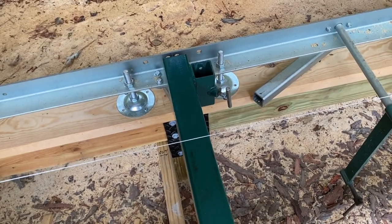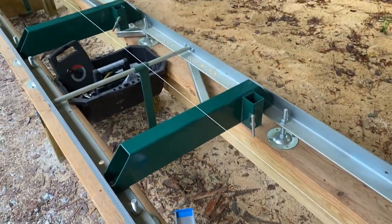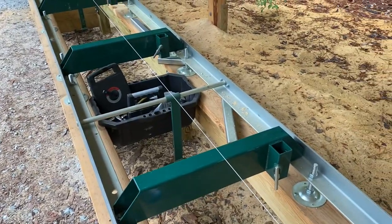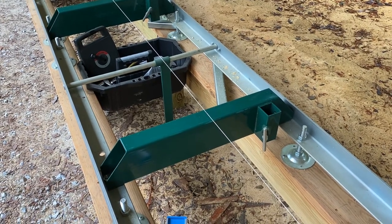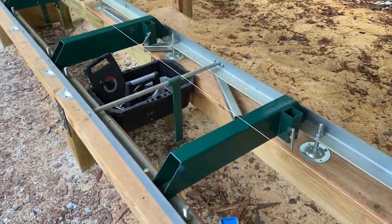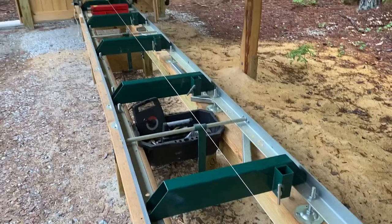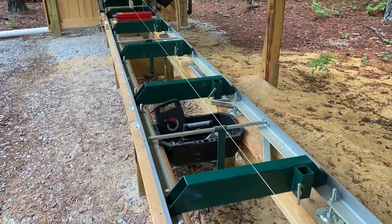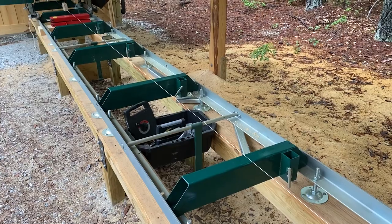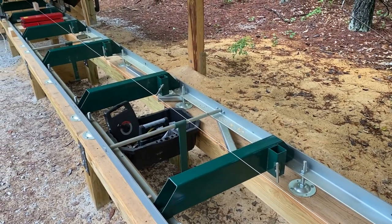Once I work my way down and everything looks good, I'll walk back the other way with the gauge block and double-check everything again. One final check is to run the level across those middle bunks I fiddled with and make sure they're back to level side to side, then verify with the block. This is going to be an iterative process, but when I set up the mill originally it really didn't take more than two passes to get everything right. I'm not going to videotape the nuts-and-bolts part — you get the idea and the rest would be boring to watch.